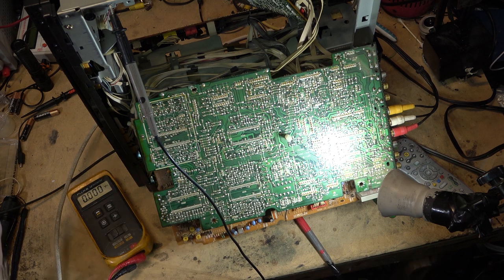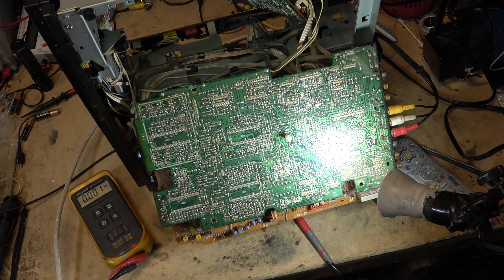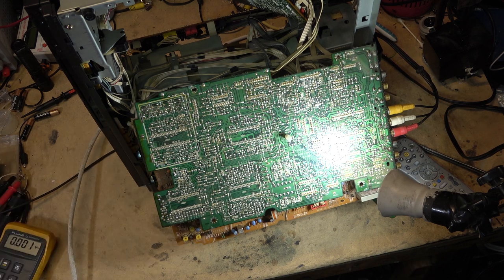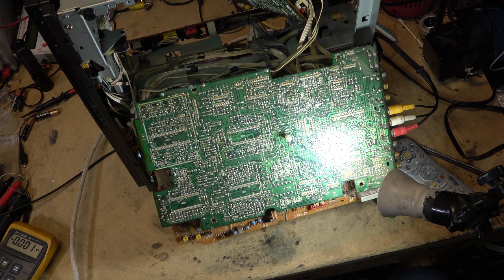And throw all this back together and we'll go back to the power supply and see where I lost the voltage. It could have been a connection on there. I just took my power supply and gave it about 3 volts. And as soon as I applied the negative terminal here, the power came back and I got my sound back. I wish I could have had the camera running when I did it. I should have started up the camera. Anyway, we know where the fault is now.